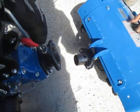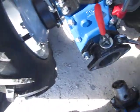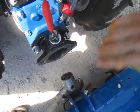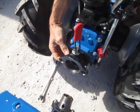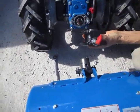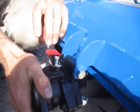Here's how we fix the problem. I'll grab my 19-millimeter wrench — same as three-quarter inch — and take these nuts and washers off the studs to remove the female from the tractor. We're going to test fit it again without the female attached. Look — it actually dropped down that time. So it was just a minor misalignment issue.